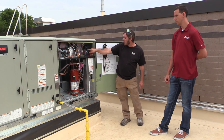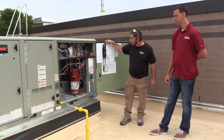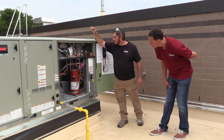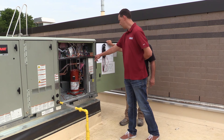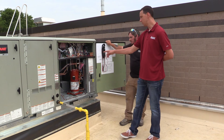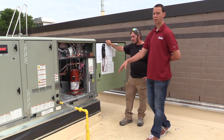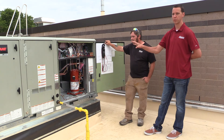Outside of that, you can move on and check the transformer — verify 24-volt output. You can also check supply power at your contactor up here, located at the T1, T2, T3 terminals. The thermostat is actually a communication stat, so it takes all its set points back up to its main control point. It's not just a standard off-the-shelf thermostat — it's a specific thermostat for this system.